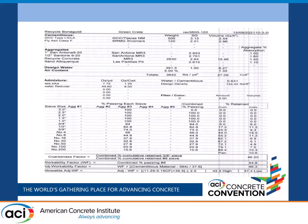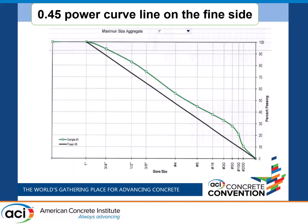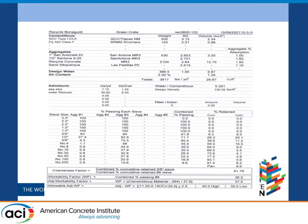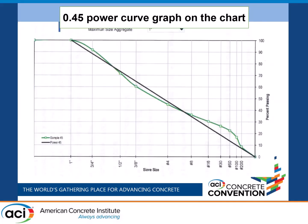You have a sustainable concrete mix. This is the program I use — it's from Gary Knight. We put the aggregate base courses into the gradation tables and I use the 45 power curve to combine my aggregates. This is what the raw base courses look like with the fines — it's all on the fine side. But if you keep it along the 45 power curve, you're going to get real good concrete. I added some number four or clean 57 stone on the left; the base course on the right has about 10% passing the 200 sieve. This is where you want to have your mixes, and on a 45 power curve it's a good way to put mixes together.